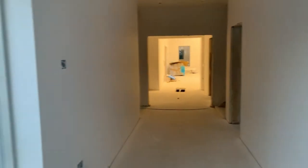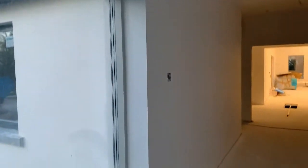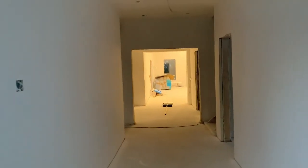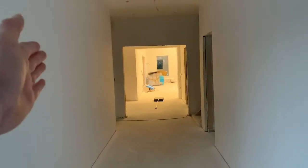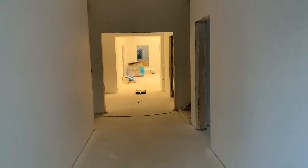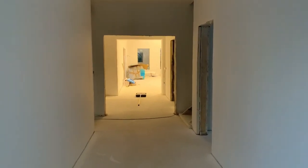I'm going to start at the front door. We've just been doing cutting in and doing our stain block — you can see the difference in color and texture around the doorway areas. We're doing stain block on our beads and around our windows so that if there's any condensation it doesn't stain. Then we got our spray machine out and started doing all the hallways, prioritizing this side of the house because our kitchen is going in a couple of weeks along with our utility room.